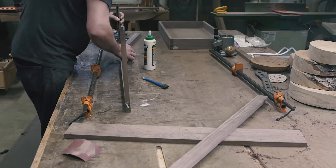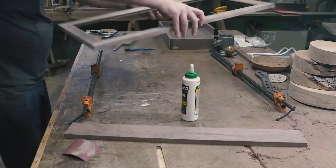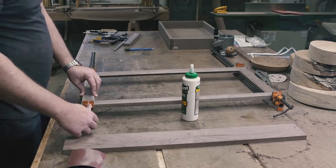If this were a regular panel door, at this point during glue-up I would add either a quarter-inch floating panel or a raised panel on the inside and clamp it up. But this door is getting glass, which takes an extra step.